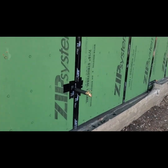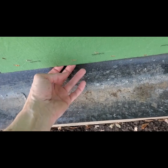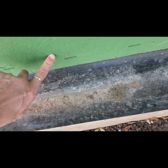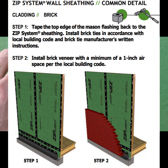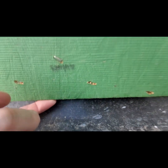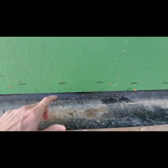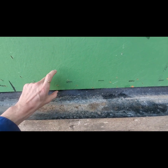The first thing I see — and I always see them do this — they've got this masonry flashing installed wrong. This gets taped up to the sheathing, because any water that gets behind the brick is going to drip down and can get soaked back up to this exposed edge on the bottom. This masonry flashing does not go behind it like it would with thermoply or something — it gets taped up to the outside.